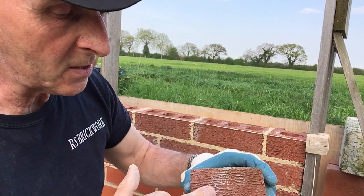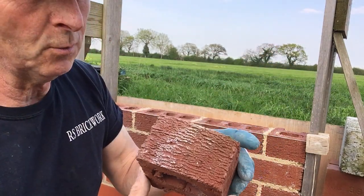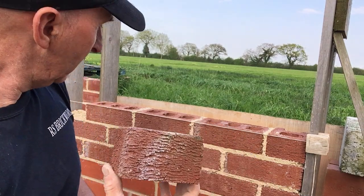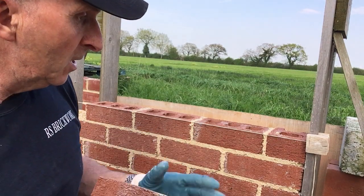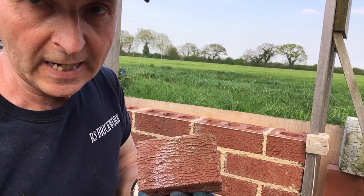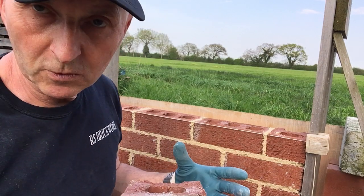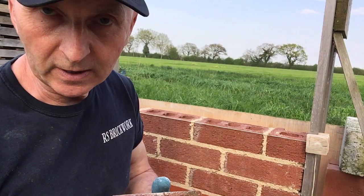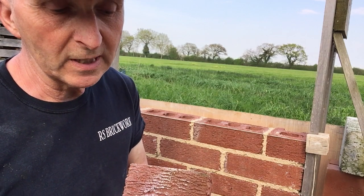This on the brick here is efflorescence. These bricks have been laying out the back for some weeks waiting for me to do these videos, and obviously the water got into some of them - you can see efflorescence starting to show on a lot of them. Efflorescence is just the salts in the brick, and not all bricks have them. A lot of engineering bricks are so dense that they don't have hardly anything in them, but with the softer bricks you find they do have a lot more salts.